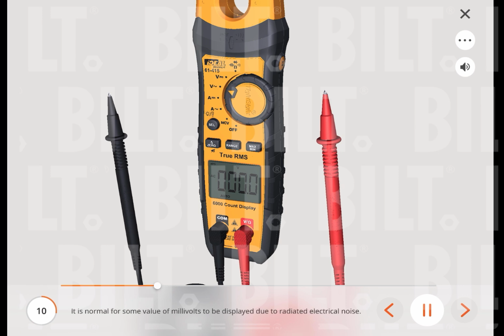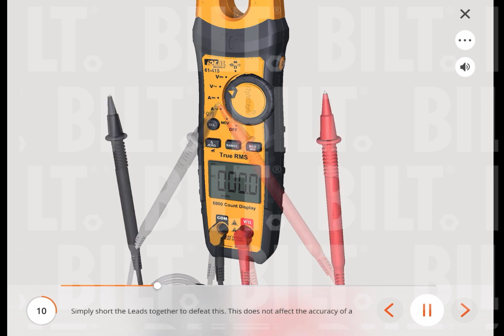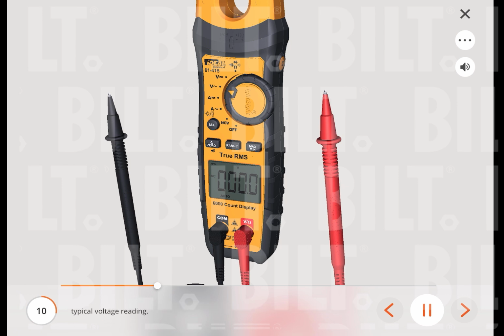It is normal for some value of millivolts to be displayed due to radiated electrical noise. Simply short the leads together to defeat this. This does not affect the accuracy of a typical voltage reading.